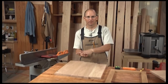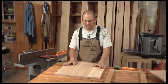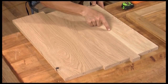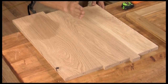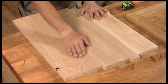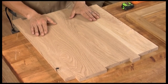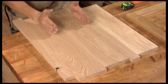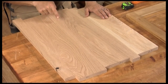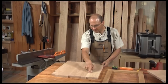I've got all my boards flat, cut 90 degrees on one edge and 90 degrees on the other edge. Everything's ready to glue up. There's one final check I want to make — I've got a knot over here and some light wood here, which is actually sapwood right near the bark of the tree. Color-wise it's not going to look very good. I want to make sure I've got even color and grain orientation going across. What's really nice is I've got a five-inch, five-inch, and five-inch wide board — I've created grain patterns that run across the joint line so the width of the boards isn't evident.